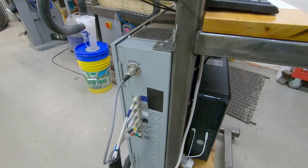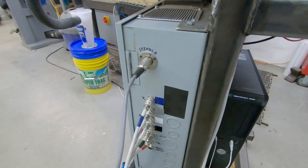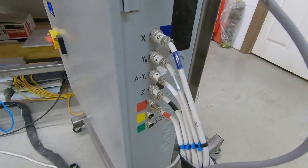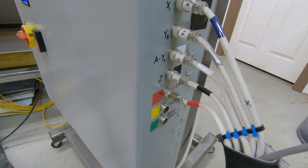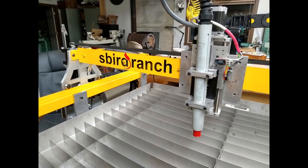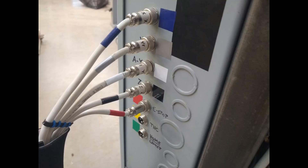Part of my original design included putting all the stepper drivers and motors on this mobile podium. The reason I did that was so I could take all the cables loose from one machine and move it to another — that other machine being my CNC plasma table. After I added a couple of new items I discovered I really needed to color-code these things, so that when I'm not paying attention I don't have to read the XYZ labels; I just match the colors and I'm done.